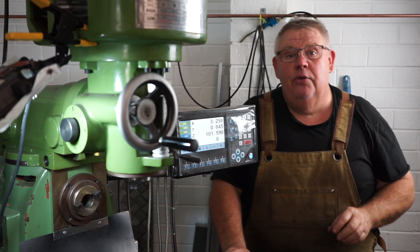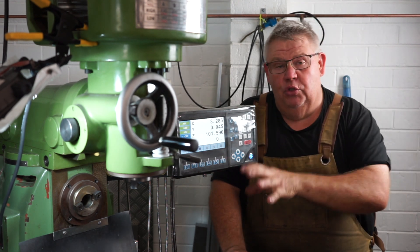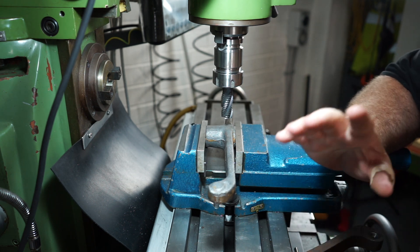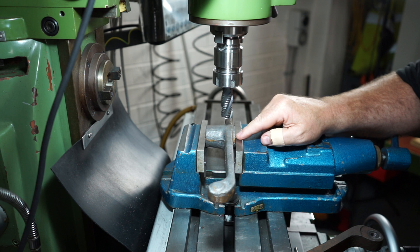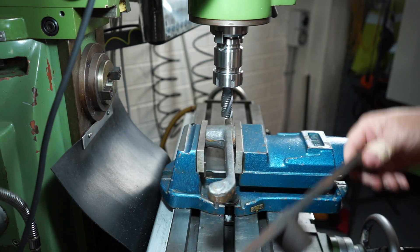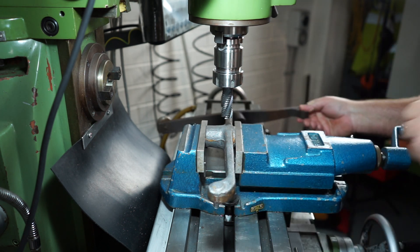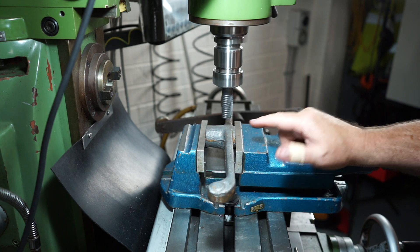Let's get into it, have a look at the video and follow along. I won't voiceover this one, I'll talk through the video. I've got you over here at the milling machine and the first operation of the day is to put a little flat on this side and the opposite side so I can hold it in the vice, and then come in and bore this hole. This cutter is from Tom over at Hilltop — thanks Tom.